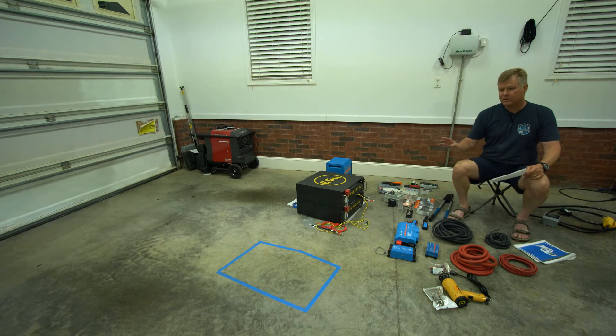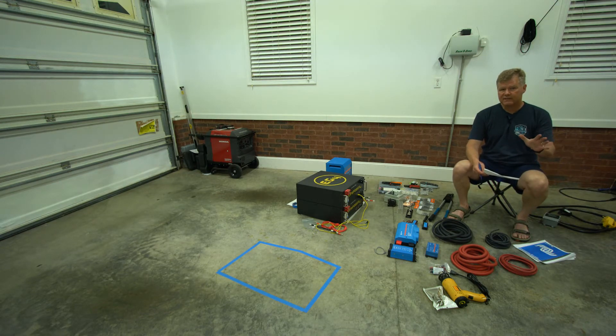The two main reasons for going 24-volt were cost and size. For cost comparison: to match 800 amp hours with 12-volt batteries, I'd need eight 100 amp-hour batteries. Two of the EG4 24-volt batteries cost about $3,000 plus tax, versus eight Battle Born batteries at $874 each — just under $7,000. So $3,000 versus $7,000 is a significant savings.